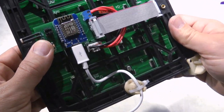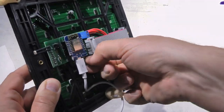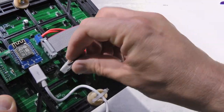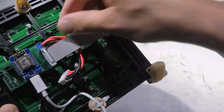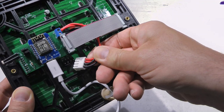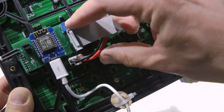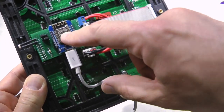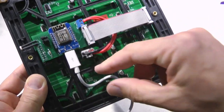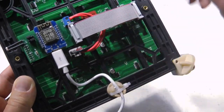There's a pull-down resistor that pulls the LDR to ground, and the other leg of the LDR is connected to 3.3V, so the two create a voltage divider sensed by the A0 input of the ESP. The power lead that comes with the display plugs into a connector with two ground and two VCC lines. I crimped the provided lead — it's like a Y-lead — and connected both ground and VCC lines to a terminal block.